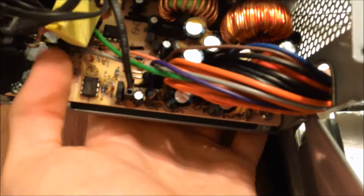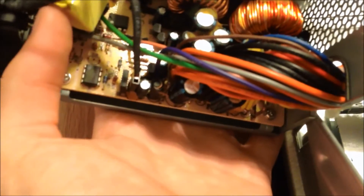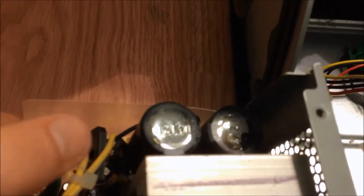I don't know — might be a transistor or something, but I noticed that one of these big capacitors over here at the other side of the power supply, this one looks fine. But this one, I don't know if you can tell or not, but it looks a bit bulged, which is very odd. You can see a little tiny bit — it's very hard to tell unless you're looking at it in real life, but this one looks a bit bulged. So yeah, I'm assuming that's the problem.